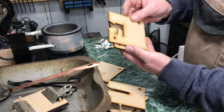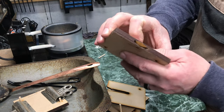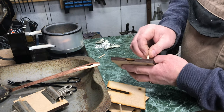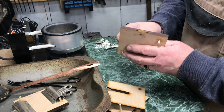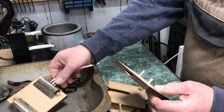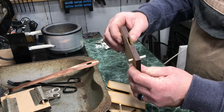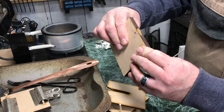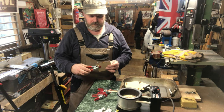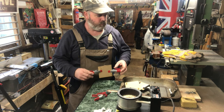Again, draw it out and file it to make a pouring channel for the sprue. Dowels hold it all together, and then all you do is put some clamps on there — strong bulldog clips or anything that'll hold it firmly together. That's how I've made the mold — just clamp them together so they're ready.